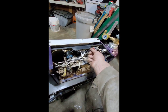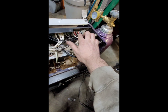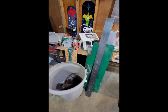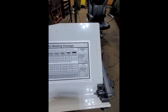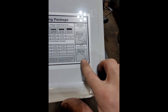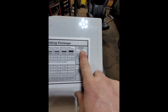And that's all you should have to do. These are just on/off with the trigger, so I don't think orientation matters — you just have to plug one into each one. There is a diagram on the panel that shows 'optional gas valve' right there, and says which pins. For hard wire, you need to switch to DC electrode positive. For flux core, you use DC electrode negative.